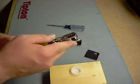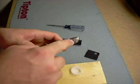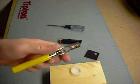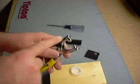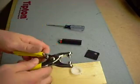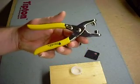And also, if you had to make your own tool for this, you could probably do it fairly easily. Now, I don't know everybody's mechanical ability, but if you drilled this out just like you would drill out a rivet, you could probably take the heads off of this, and then maybe, and I know it sounds like a lot of work, you could probably tap that, and then screw in a long bolt or something and Loctite it in, and you would actually have your own little tools. You could set it up in a jig or however you wanted to do it, maybe with a long arm, that way you get more leverage.